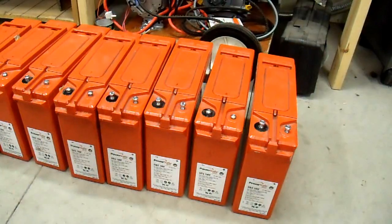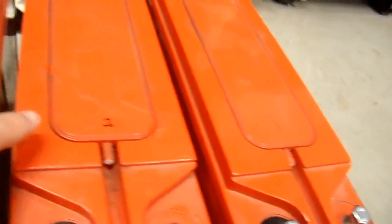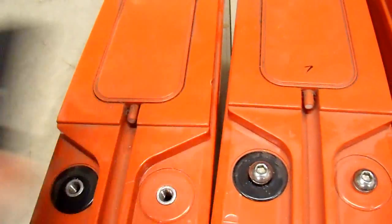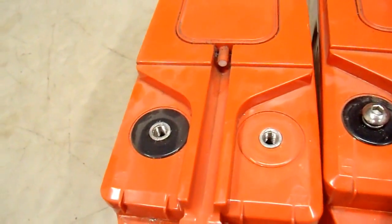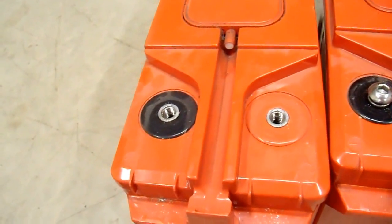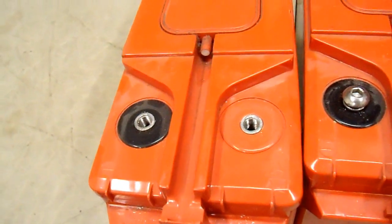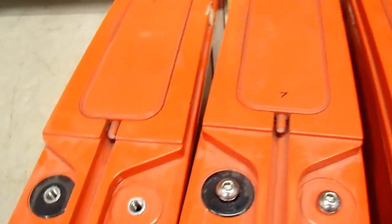I think they're going to be okay. That is the first step. To keep track of what I've done with each one, I've labeled them: one, two, three, four, five, six, seven, and this one which I marked with an X — because this one is bad. This is the bad battery. It has a dead cell inside it. It's partially shorted, partially open. It reads about ten to ten-and-a-half volts and will not accept any sort of charge. This battery is completely junk, non-salvageable. But that's fine — I still have seven more batteries to go.